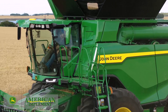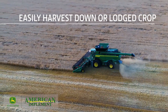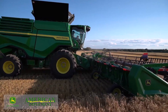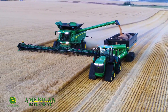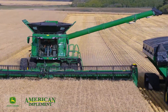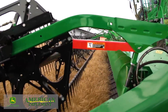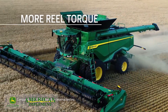If you have down or lodged crop, you can quickly convert from off-ground cutting to on-ground cutting in less than 10 seconds. Our hinge drapers have a closer reel clearance and deeper ground reach than the 700 flex draper, increasing the reel's ability to go down and out. There's also a 30% increase in the reel's maximum height, and you can easily harvest lodged crop thanks to a 24% increase in the reel drive's motor torque.